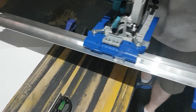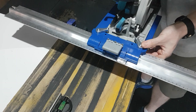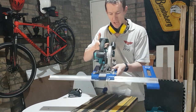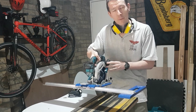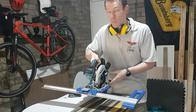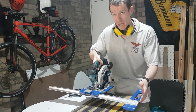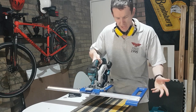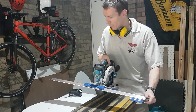I can now unlock this and set it to any size cut I want to make, and when I lock it back down I know that cut is going to be exactly 257 millimeters. Well there you have it — that's a quick tutorial on how to set up your Kreg Rip Cut jig. It's going to get a lot of use when I'm cutting up plywood sheets. It's also going to let me make smaller accurate rips for my router table project. At about $70, I got it from Carbatec, it came very quickly, and it seems sturdy just like the other Kreg stuff I've got. I got onto Kreg through Woodworking for Mere Mortals — they sponsor Steve over there and I'm glad they do because I do like their products so far.